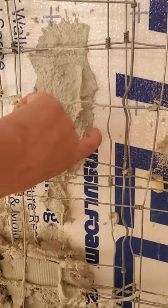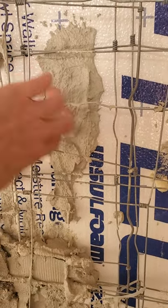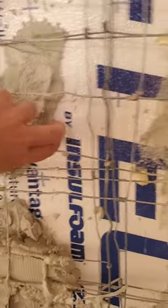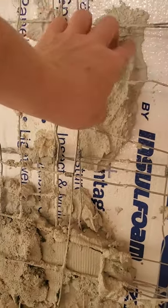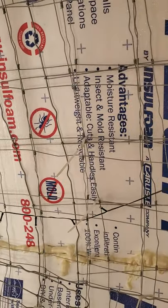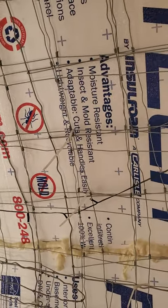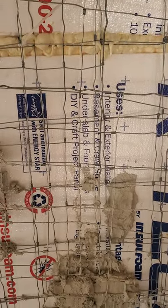Over here is where I practice throwing the hydraulic cement onto it. I stopped because it felt like it was wasting — some was falling and it wasn't very controlled — so I'm waiting to get a hopper. It was sticking fairly well. I'm going to do the first layer with the hopper with some glue. Once it's sprayed and dries, it'll be like a solid sheet that is not going to go anywhere, because it's really strong and sticks to itself.